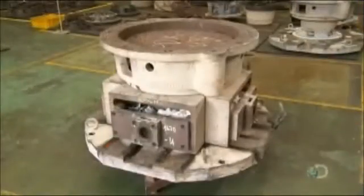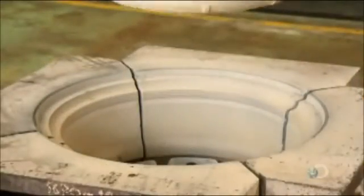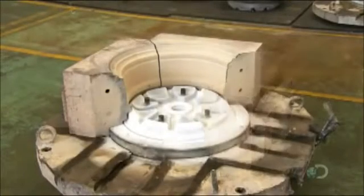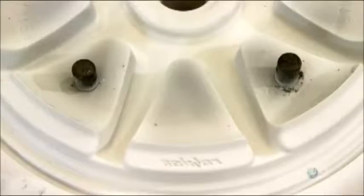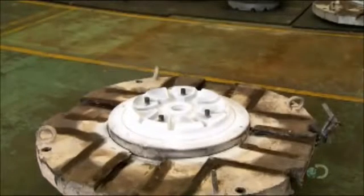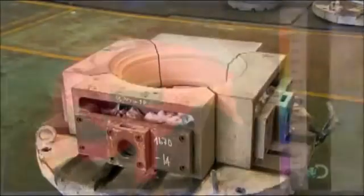The wheel mold is made of high-strength steel. It's actually a set of 3 molds: the upper mold, which forms the inside face of the wheel, the 4-part side mold, which forms the wheel's edge, and the lower mold, which forms the outer face. That's the side with the design, so this is the most intricate mold. It takes 3 to 4 weeks to produce a mold.